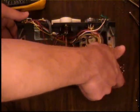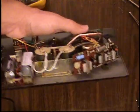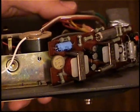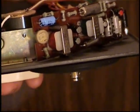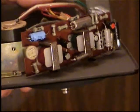But I have replaced the resistor on the amplifier for the bias with a trimmer. And I will be using that to adjust the bias. I have it set to about 43K or something like that right now instead of the original 25K. And we will be doing some record tests and maybe tweaking the bias and then doing record tests and so forth.